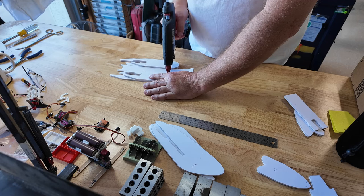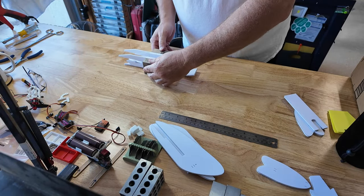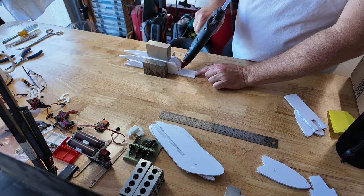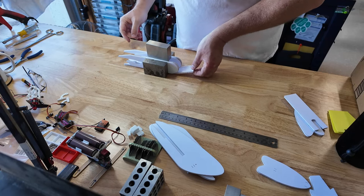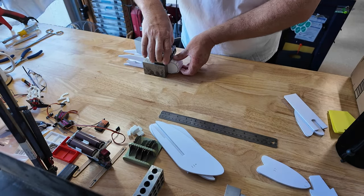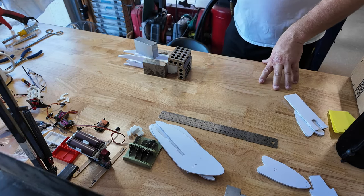Now a little bit of glue on the underside, along this line. We'll bring these two sides up — a couple of weights. If you press them in at the base, they'll keep everything nice and square. A little weight just to keep everything touching down, and for the nose. Keep pressing each segment aft. I want that top piece flat. We're going to let that cool for a minute.